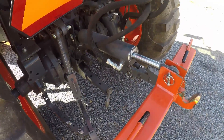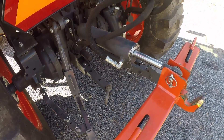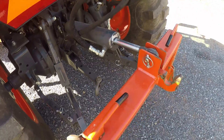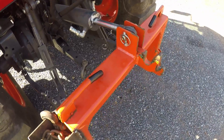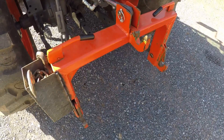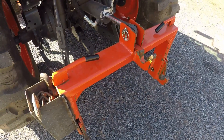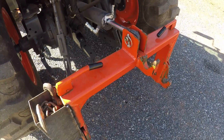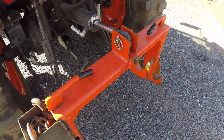A top and tilt kit is great for grading implements like a scraper blade or a box blade. They also work great with pallet forks on the three-point hitch. And you can see I have a quick hitch on this tractor. The hydraulic top link and side link make hooking up to implements a breeze even on uneven terrain, because you can just quickly adjust and pick right up on the implement.